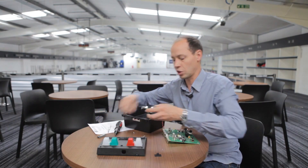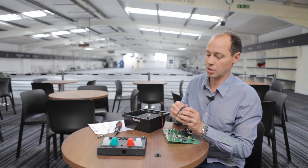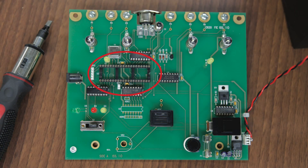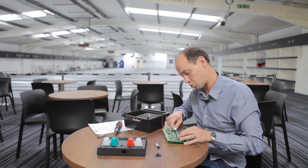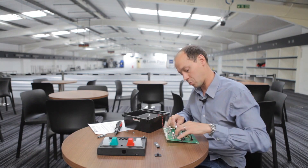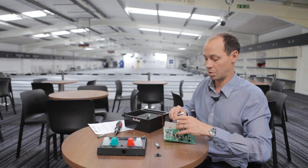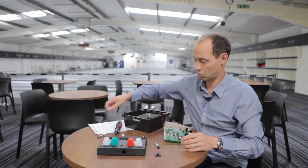Take your new chip — the way they come, the pins are slightly further bent out than the slot you're putting the new chip into. You can check that just by levering the chip up. Put a flat-bladed screwdriver under the edge of the chip and lift it up from one side until you've got the old chip out. Be careful as you lift it out that you come straight up, rather than bending it out to either side.